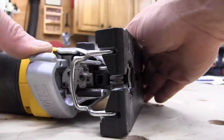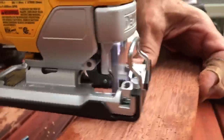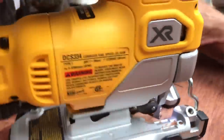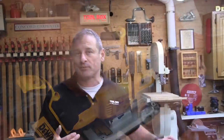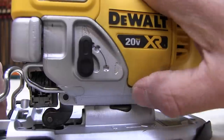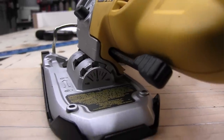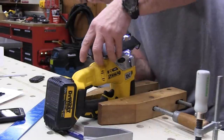The front of the saw has an all-metal keyless lever-actuated blade change, and that screams quality craftsmanship and mechanical design. This jigsaw utilizes a T-shank blade system — I prefer T-shank blades; they have better quality. It also features a one-inch stroke length on the blade. There's a four-position orbital action switch that allows the jigsaw versatility for cutting different types of materials. As far as beveling goes, the all-metal keyless shoe bevel has indents at 0 and 45 degrees and holds its position between those settings really well.